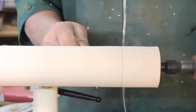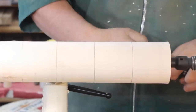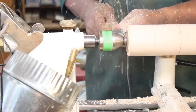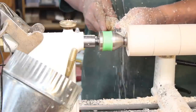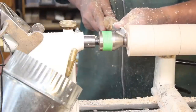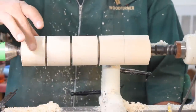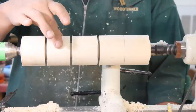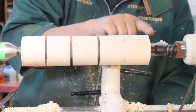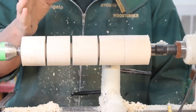What I'm doing now is roughing down a nice hard maple blank which is going to be the roof of my ornament. I'll make several roof pieces out of this longer piece of hard maple. Now I'm marking out equal segments that will eventually be different roof units for my birdhouses, and I'm starting to form tenons on each little section. I can take the big blank to my bandsaw and cut those apart — the tenons will already be there. This is as close as I can get to mass production. I've got tenons on both ends and in the grooves between, so all I've got to do is cut those on my bandsaw and I'm ready to go.